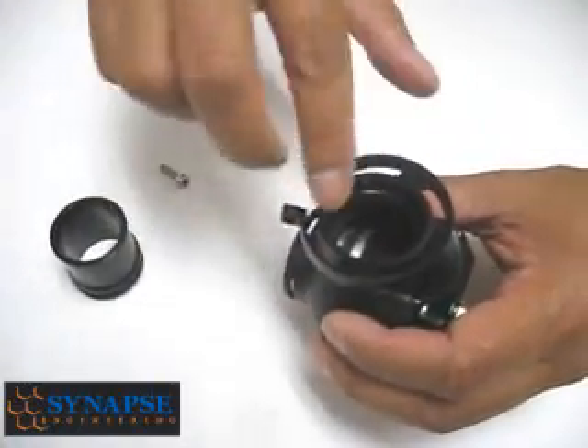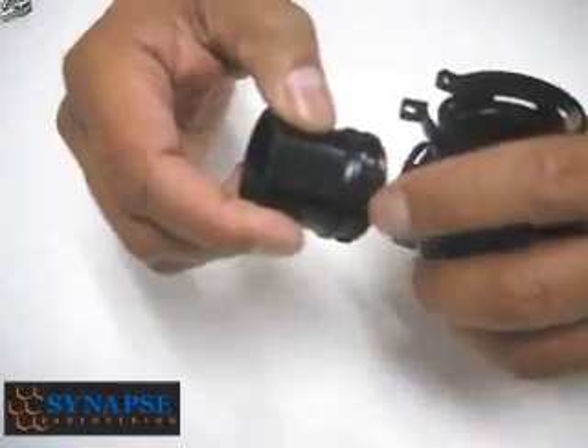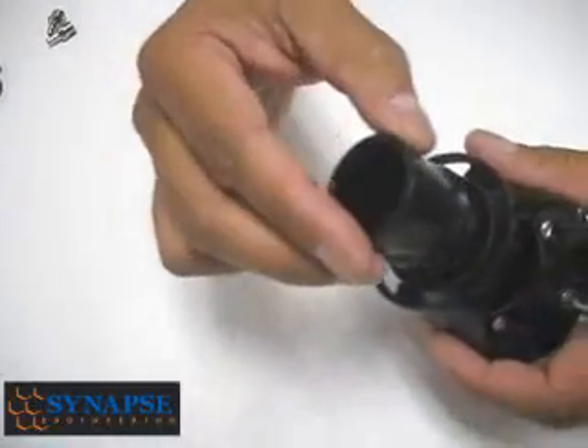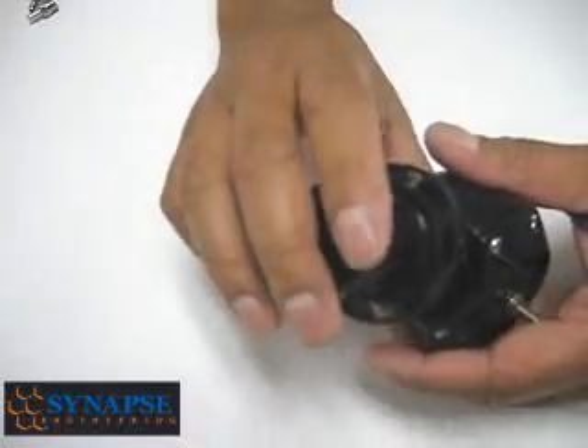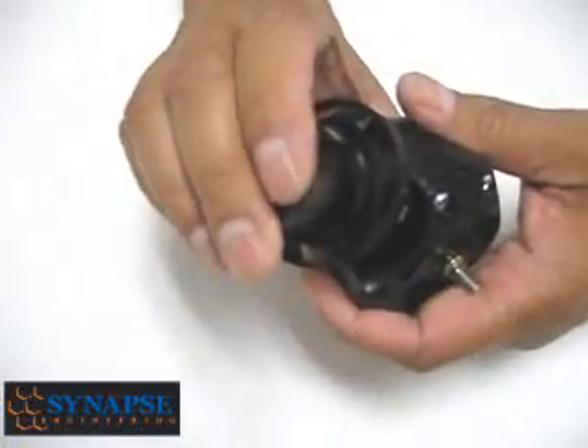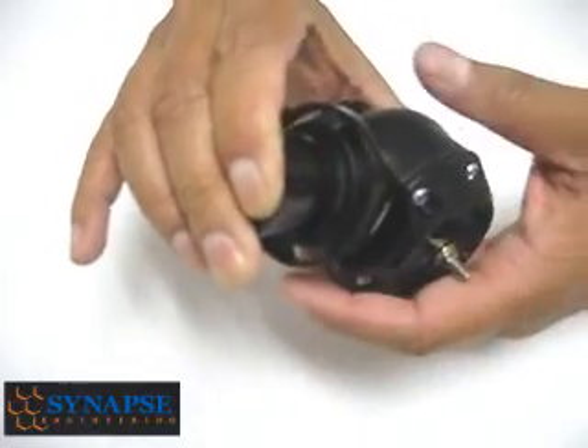The O-ring does not go onto this groove. The O-ring goes in, you put the flange on, and then you don't tighten the clamp right away, because the flange actually has to get pushed down about a millimeter or a millimeter and a half to hold it in place. Otherwise it's going to keep popping out.